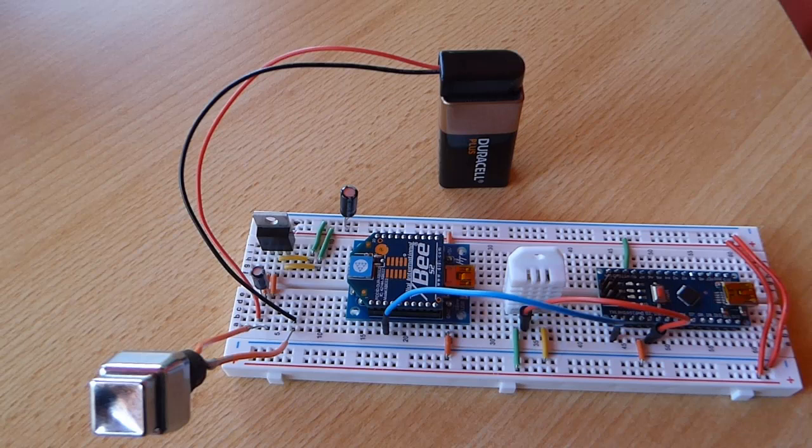One thing to remember about electrolytic capacitors is that the cathode side must be placed in the ground rail. The cathode side is identified by a grey band running top to bottom. In some products, this band is black instead of grey. If in error you put the cathode connector in the positive rail, the 5-volt regulator will overheat and can be destroyed. It will also burn your fingers on contact, so turn off the power first and let it cool down.